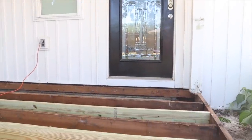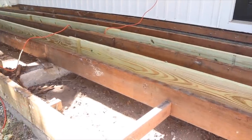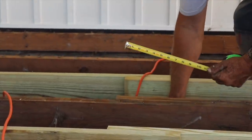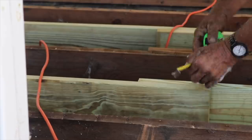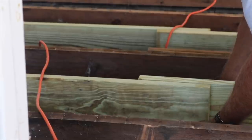They didn't used to have green-treated wood when this joist system was originally constructed, so a lot of this wood just did not withstand the elements outside. Prepping to lay the new floor took two days, and here you'll see John measuring 12-inch joist centers, moving the 2x8s where we needed to go, and then screwing them together.